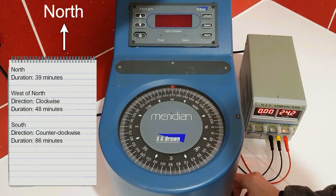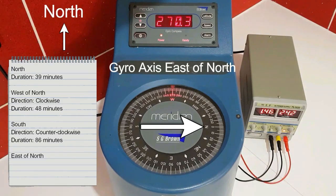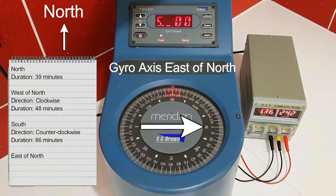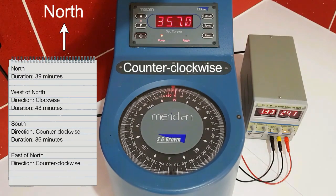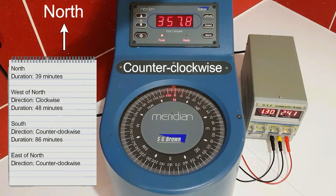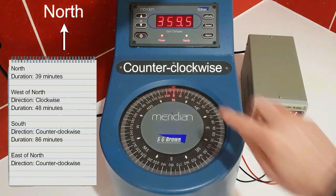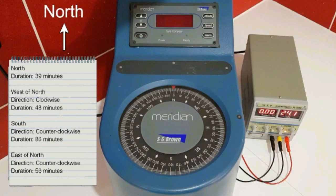What is still puzzling is why it seeks true north - why does the y-axis tilt down when west and up when east? I've done initial testing by entering false latitudes and find it interesting that you need to enter your latitude to begin with - this is true of all gyro compasses. So it alone cannot seek true north without intervention, and entering a false latitude causes an error of as much as five degrees off true north. I plan to do more testing with false northern and southern latitudes, but I hope you enjoyed this demonstration - to show that a gyro compass seeks true north in whichever direction is closest, not always clockwise as would be the case if rotating on a unidirectional body while remaining rigid in space.